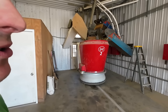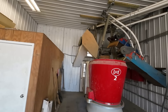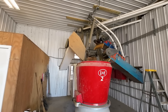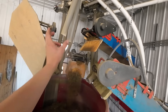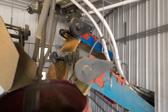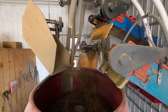The other downside with one long conveyor is you'd have two conveyors running at all times, which would actually be more wear and tear. This setup is really the simplest possible — you have one straight conveyor from each silo. It looks not straight because everything comes in at an angle. Right now we're running corn silage out of one of the silos close outside, so all we have is this 18-foot conveyor running. Having a separate conveyor for each ingredient was a real priority because we think it's going to give us the best chance of being accurate.